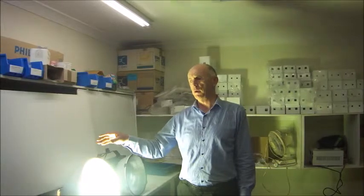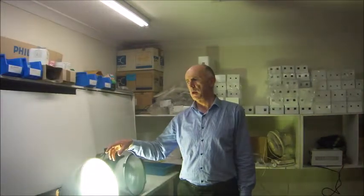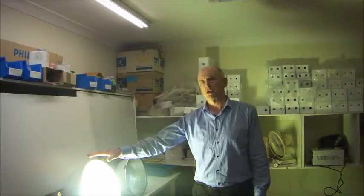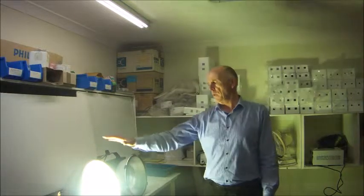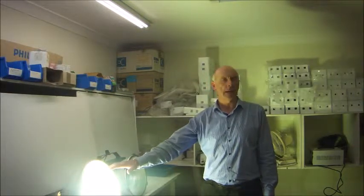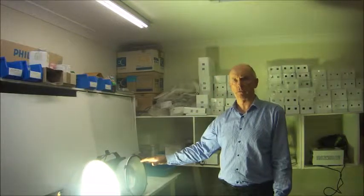This is the measurement of the dropout voltage of the mercury vapor. Now we'll gradually wind the variac down — slowly, slowly. There, 188 volts. We've got 435 watts in the mercury vapor fitting here and 154 watts in the LED fitting here. We've got about 135 lux at 6.5 metres and about 350 lux at 3.5 metres.